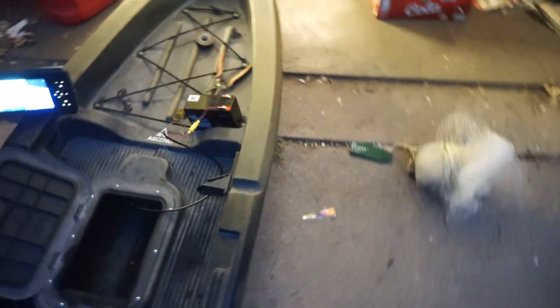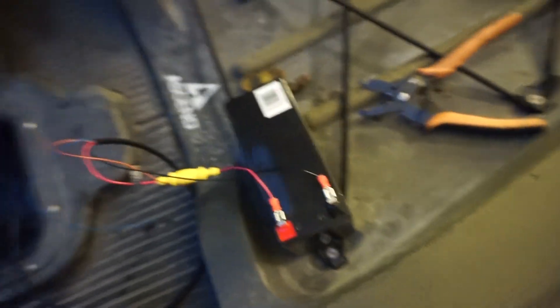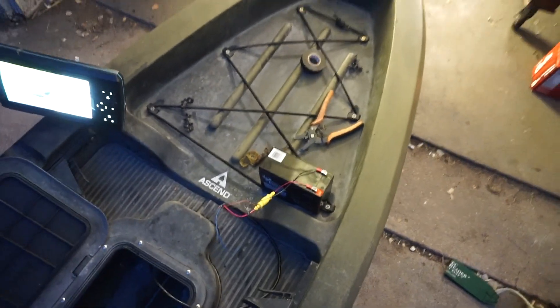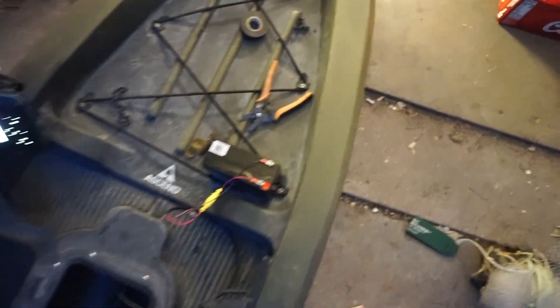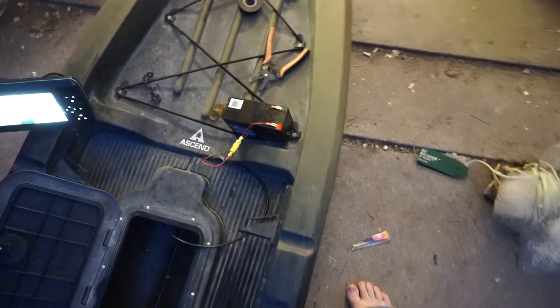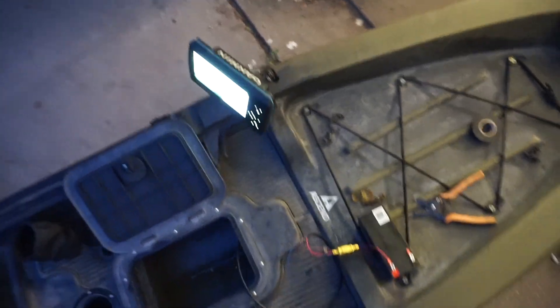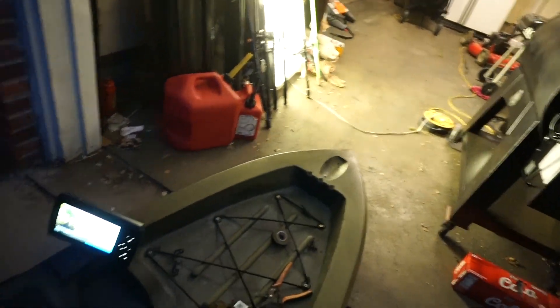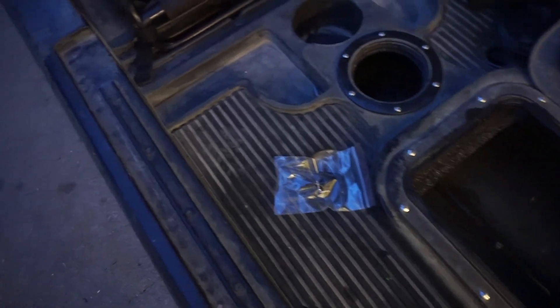I got the battery wired up — it wasn't hard. All I did was get some female ends for this male end. This is just a regular — I think I got this for a deer feeder, wild game. I think it's like $20 at Walmart — 7.5 amp hour. You just put two butt connector female ends on there and slide them over your battery terminals. I know you guys are going to say you need a watertight box to put your battery in — I will, it's coming, I just don't have the money for it right now. I'm going to seal up this front hole and leave that back one unsealed until I know how much sealant I need for that transducer arm to work back and forth. You just have two wires on the back here, you plug in after you run them up. Pretty self-explanatory — you just take that, close it on up.